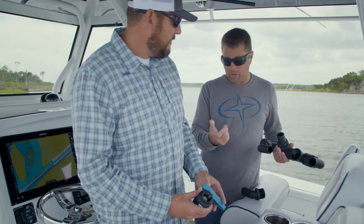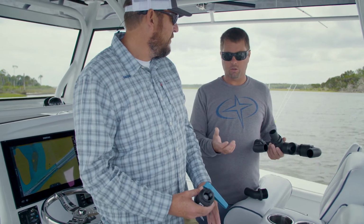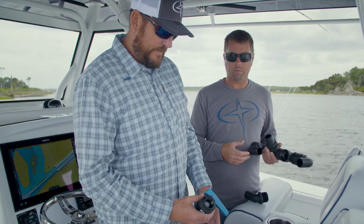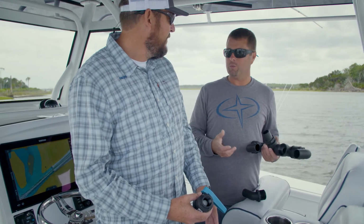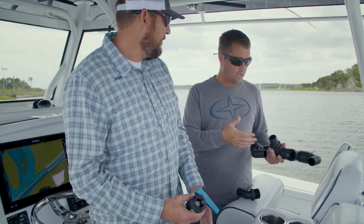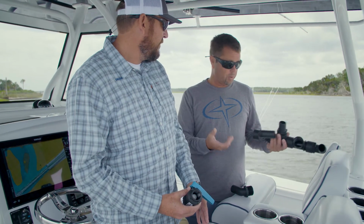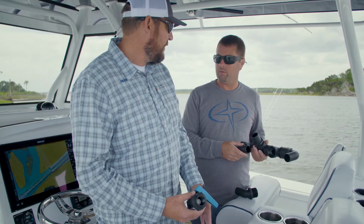And then three, you're talking about the brass. To me, that's the greatest thing: one, no more bonding, and two, you just don't have that green drip and slop that makes a bilge look terrible in a year or two, because there's just no way around it. There's going to be salt water in your bilge and it's going to get dirty no matter how clean you are, but it is nice to be able to look down in there and it's nice and clean. I was sold on it after spending the day changing some valves and putting some fittings in here. I was like, this is clearly better, way better than anything.